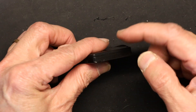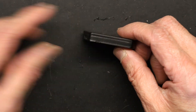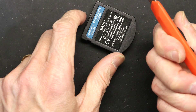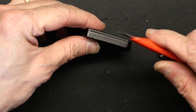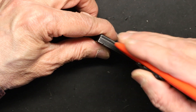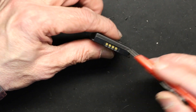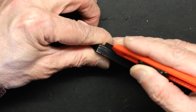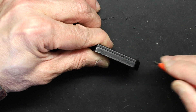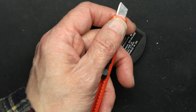The battery is glued together — it has an upper shell and a lower shell, simply glued together. What you need to do is use a fine blade and start cutting very carefully. You can't go too deep because you will damage the cell, and if you go too deep on the other side you will damage the board. Do it one line at a time and make sure your blade is sharp.